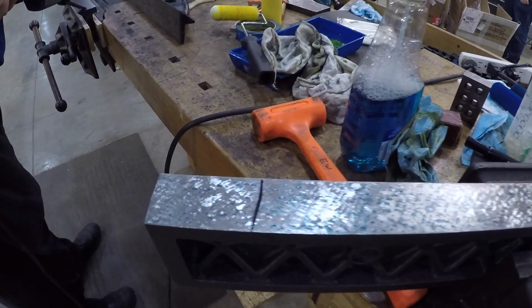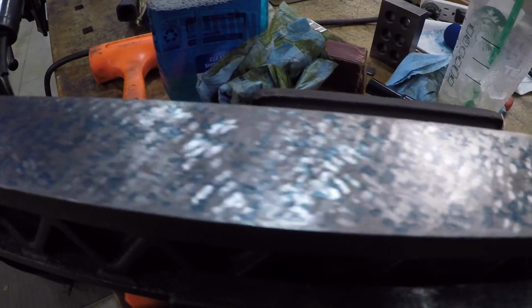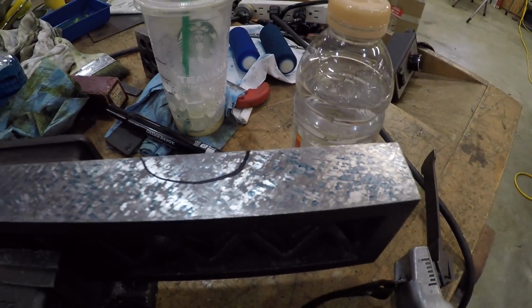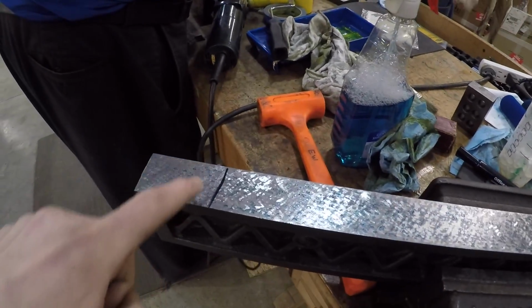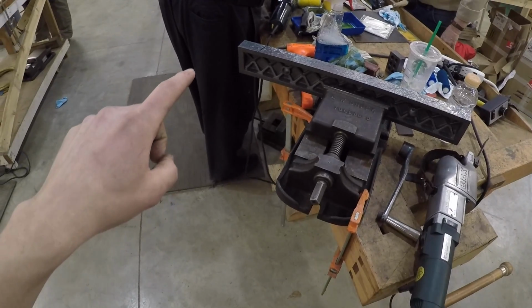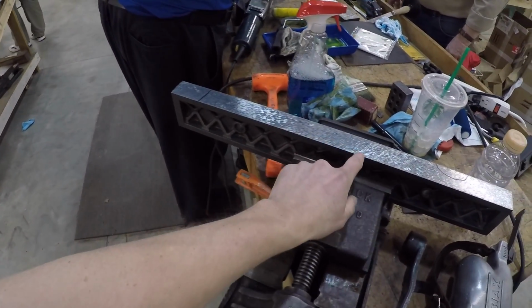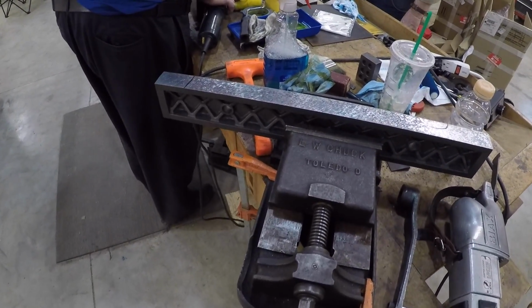I've got pretty good points per inch. You can see the bluing of the scraping. And you see where my Sharpie is. I've got a little bit of a low spot here and a low spot there. When I mean low, I mean I'm making contact better with the areas here that have the blue in it. And, like you just saw, pretty darn parallel.